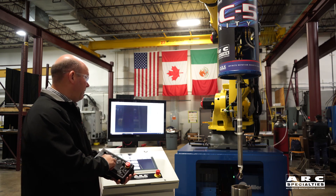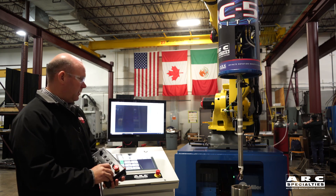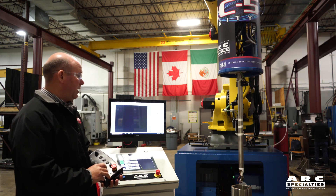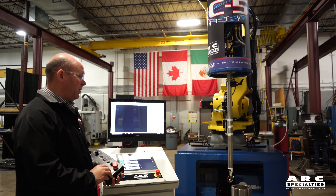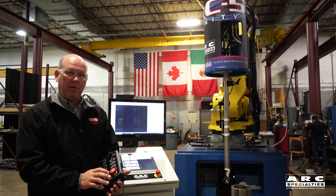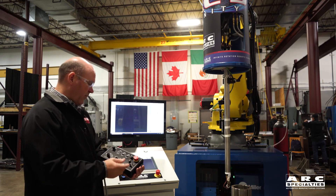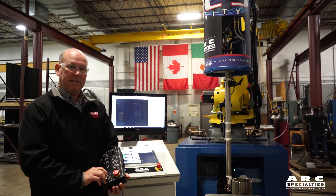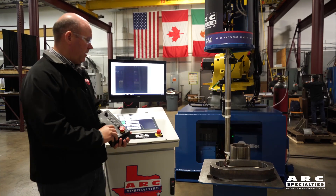I can put the mode into X, Y, and Z motion, so now you see the entire robot is moving that torch across the X/Y plane. Most of the time you'll use this to position the torch — instead of using a robot pendant or anything like that, it's all tied into the controls of the machine. So I can bring it down and back into this bore here to set up on a racetrack or whatever other shape you might have for your cladding process.